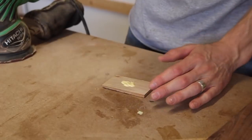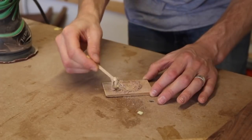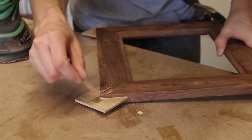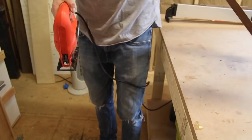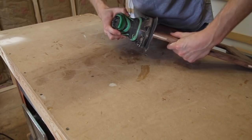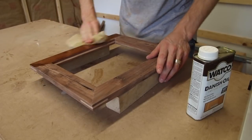There were some small gaps in my frame where the corners went together — it wasn't perfect. So I mixed up a little bit of glue and some sawdust, filled in the cracks and imperfections, and also filled around where I added the splines. This made a big difference on the end result. After that, I used the jigsaw to cut off the splines, sanded them down to be even with the rest of the frame, and then used Danish oil as the finish.